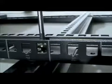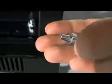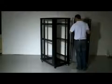When Step 4 is complete, repeat Steps 3 and 4 on the opposite side of the rack enclosure. Step 5: Fit the front and rear doors using the door pins provided. Place the door pin into position, then line up the hole in the bottom of the rack door and lift the door onto the door pin. Secure the door in position using the spring bolt.